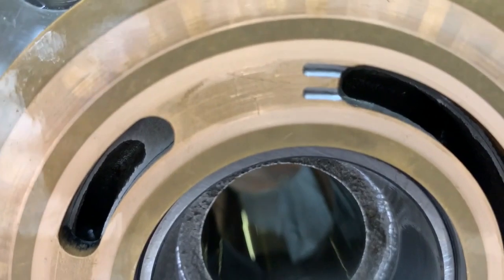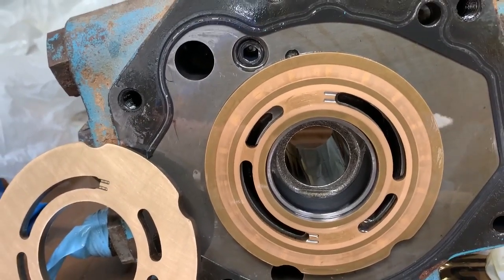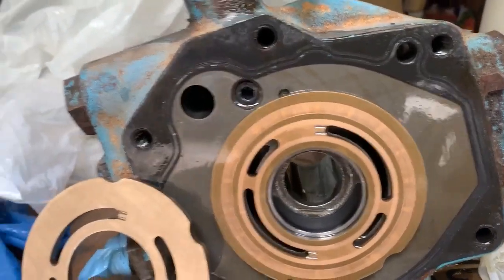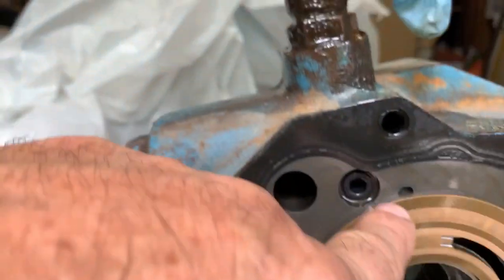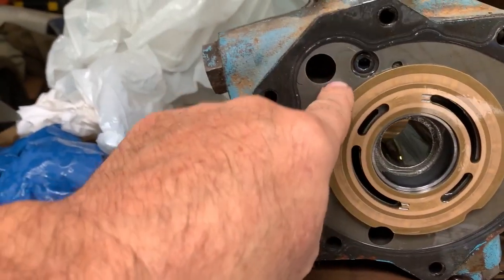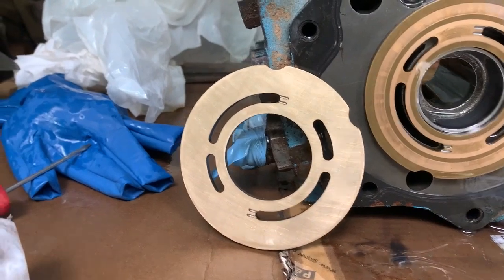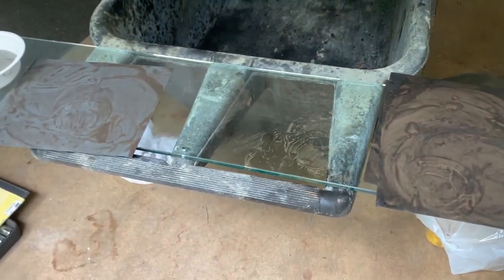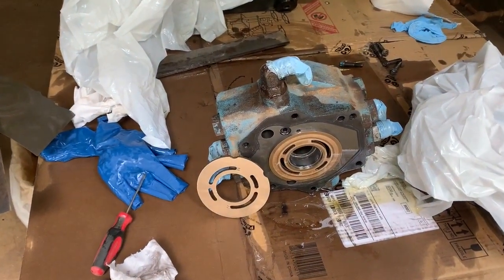You can see those scratches in there. I had trouble getting off the wear plate — the wash plate — and wasn't certain how to do it. I finally got bold and took a little screwdriver, wrapped it with a glove so it was soft, pushed it through this little hole, and pried just a little bit and it came right off. I think the oil creates a suction that causes it to stick, but there's nothing actually holding it on — it comes off easy. I cleaned it up on some glass using WD-40, then dumped it in gasoline to clean it and let it evaporate.